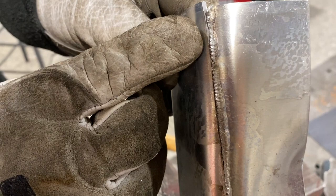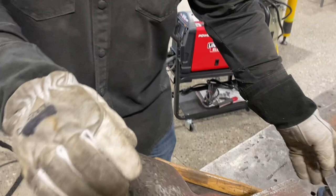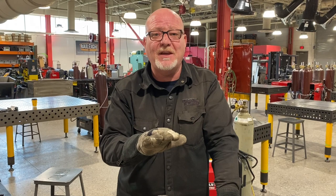We've got some videos in there for you — there's a video on an aluminum butt joint using the keyhole technique, and there's another one on steel. Just remember, when you're doing butt joints, you have to have full penetration. The thicker the metal, the better the penetration you need for strength. Take a look at the video, watch the edges, and watch that keyhole form, and start practicing your keyhole technique. See you next time.